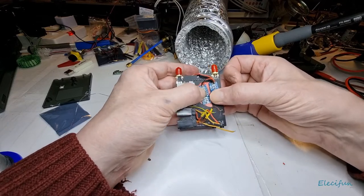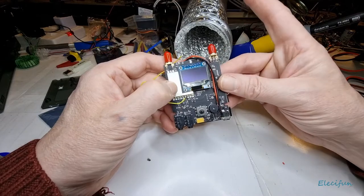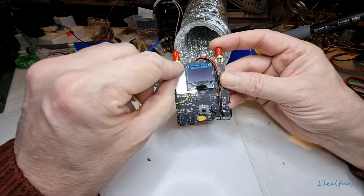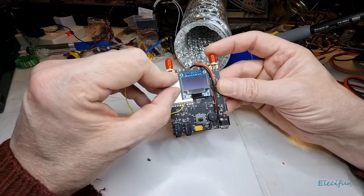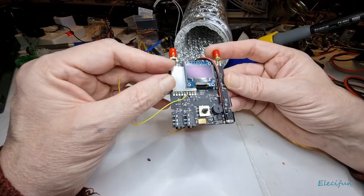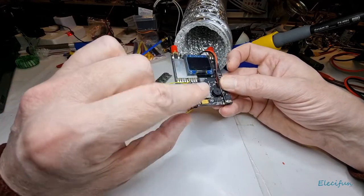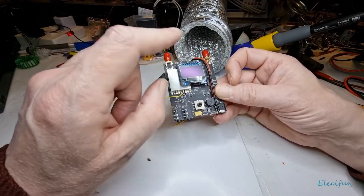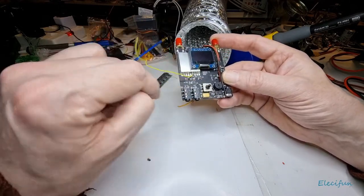And as soon as I found the double-sided sticky tape, I'm going to stick that in like that. So we know as well that that's antenna 1, antenna 2, because it's got them set here. So if you ever wondered which one was antenna 1, as it's facing you, this is antenna 2. You've got two outputs for your video. So you could put one channel on one frequency and one on another and have two outputs.